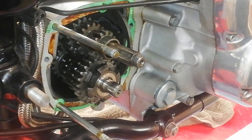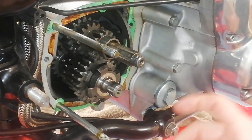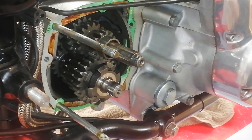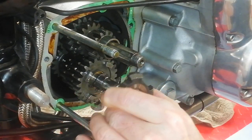I'm going to start removing these, and I'm going to lay the gears out in order on the bench as an aide-mémoire. I haven't actually taken the gearbox apart for several years and you think you remember it and of course you don't. So I'll put them on the bench facing the right way in the right order, just to make life easier for reassembly.